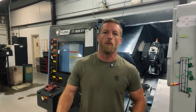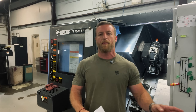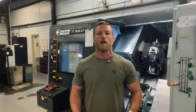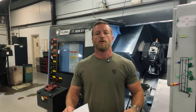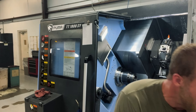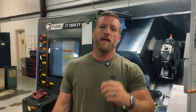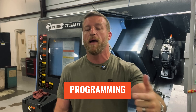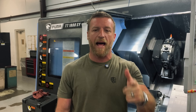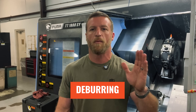The three topics we're going to cover in this video — you can break it down and cover about two or three topics here, one or two here, probably 15 different topics. But these three will make your thread go from sharp, ugly, and non-functional to absolutely beautiful. When I make a thread, I like to be able to grab that part, run it in my fingers — I want it to feel like a piece of jewelry, smooth and beautiful. The three we're going to cover: tooling selection, programming method, and last but definitely not least, deburring the thread.